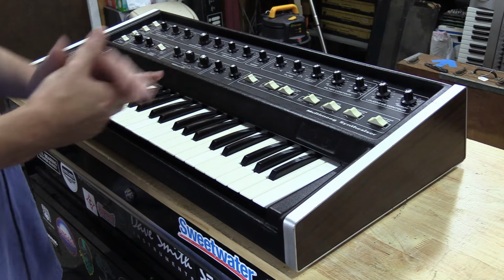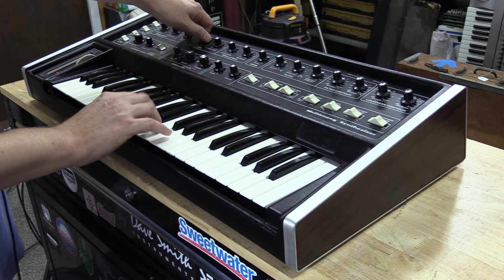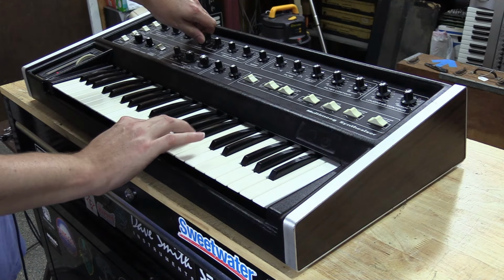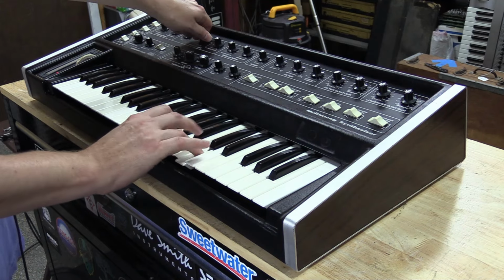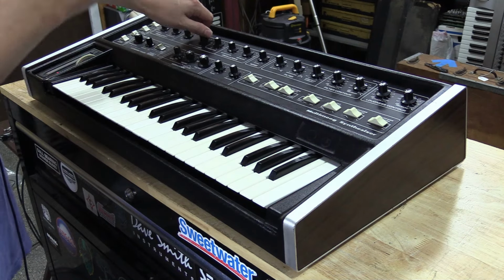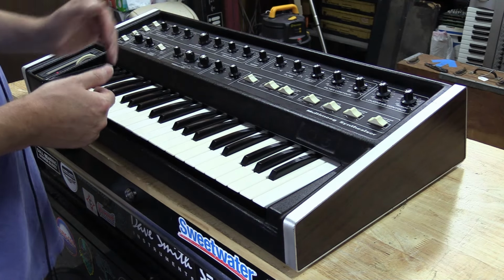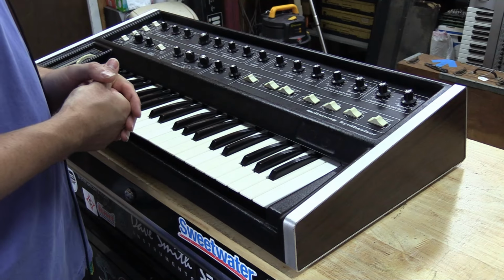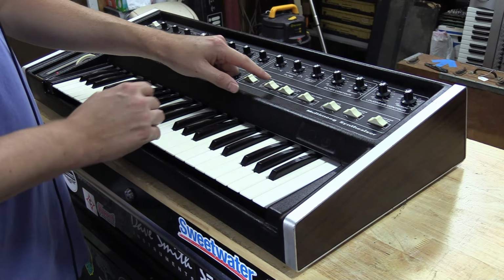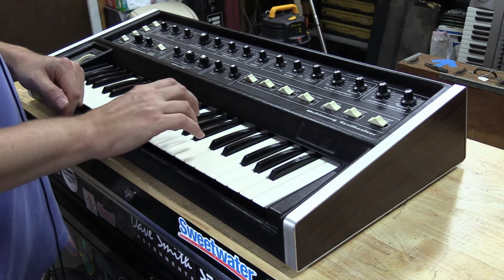As you can hear, now it's actually a tone, a sine wave generator oscillator. And we got the footage, which you'll hear what I just talked about. So there's your filter working as an actual sine wave oscillator with its own footage here. So that's a really cool function there of this filter. If we turn it out of tone and then we just go back, as you heard, it doesn't do anything, but it's excited off the harmonics. So it actually gets a resonance based off harmonic content.